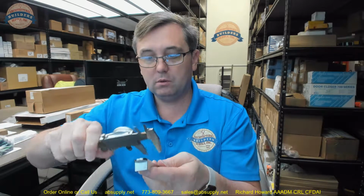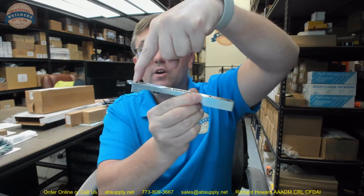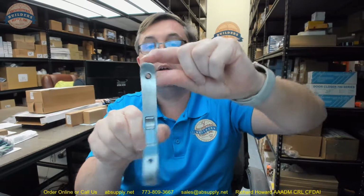And that bolt is probably 3/4 overall width. A little bit shy on that. My caliper tells me about 0.734. Seems to be pretty consistent. 0.735. So you're going to take a 3/4 inch diameter router bit, and you're going to enter the workpiece, come all the way in. You're going to stop so that you achieve that 3/8 radius at the end.